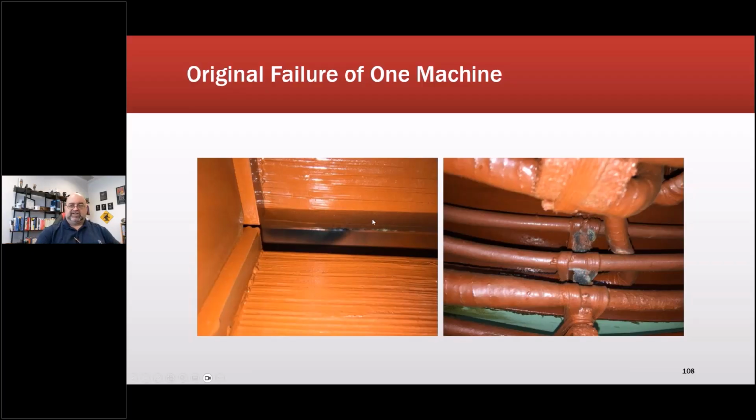Apparently everybody was afraid to say that. So there was that. We also noticed when we were doing the visual inspection, going in there with a flashlight, going down, looking and seeing that there was PD on the leads coming into the machine. That's what that looks like, the end of a cigar. That's PD, or partial discharge. We discovered some other things, like these leads, when they go out in the connection box, are all touching each other. So we detected evidence of PD on those as well.